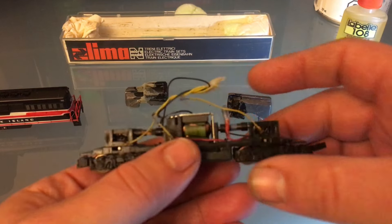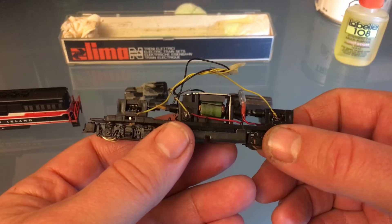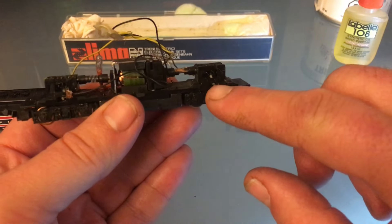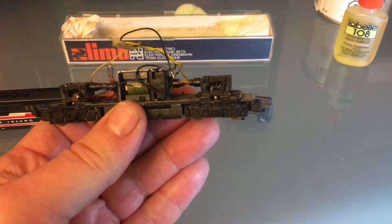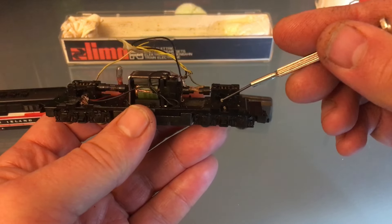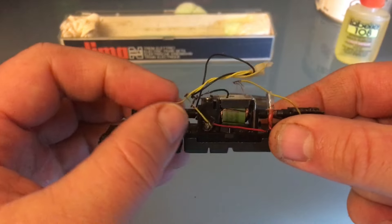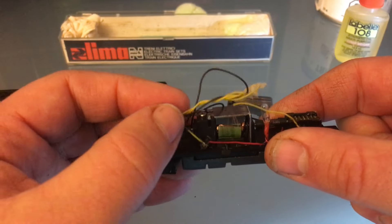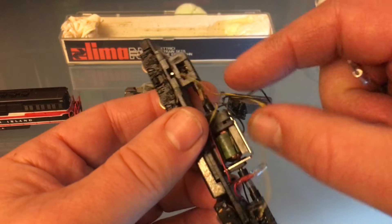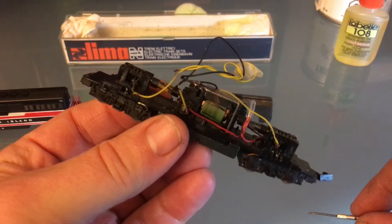While I'm working on the wheels, sometimes you'll see you get these and they're running poorly — poor electrical pickup. Often it's these little tabs here that are desoldered from the wire, which is the case here. So as I go around cleaning this, I'll be making sure to manage this. Since I've got to redo all the wiring anyway, I'm going to cut all these wires here. You can see the insulation melted here, so that is no bueno.